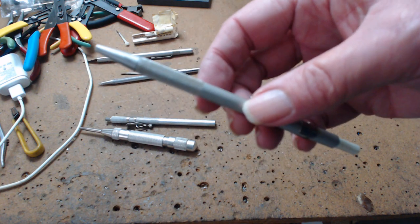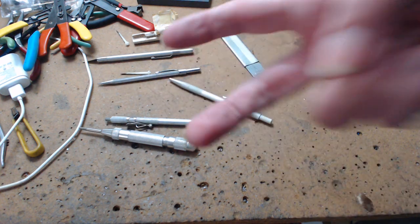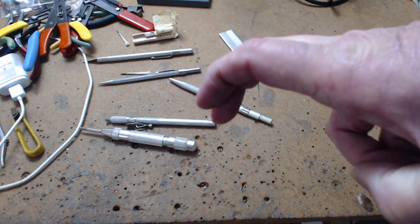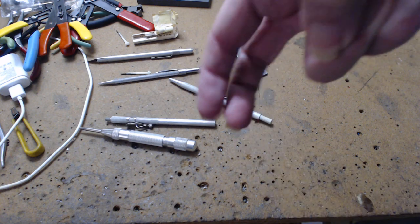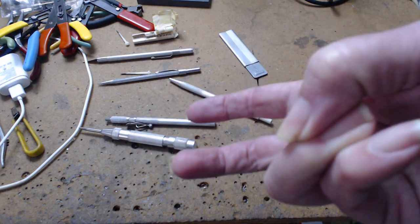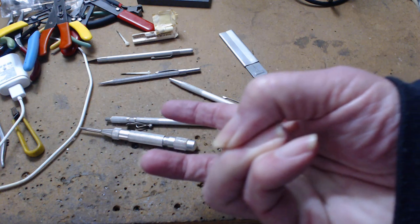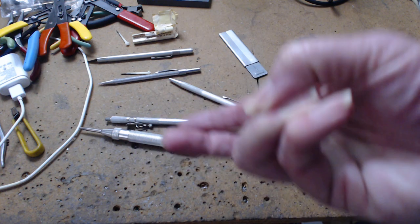And we had a tool for removing ICs. I don't have one. But it was a pair of pliers that looked like this. Okay, I can't get the 3D like that. See how my fingers are bent? There were tips here. You cut the pins. And then you went across the IC and cracked it or whatever you wanted to do. Sometimes you'd unsolder the chip, you go across it like this, and you crack the pins loose from the traces, and then you rock it, pull it out.